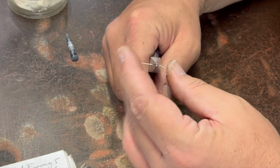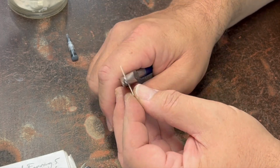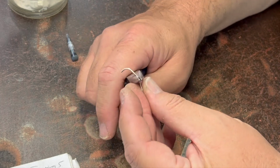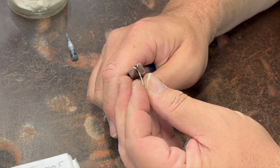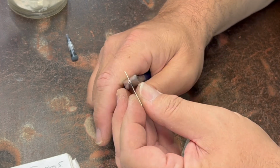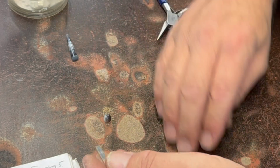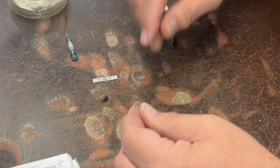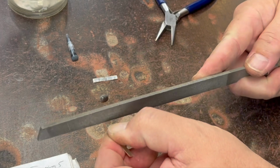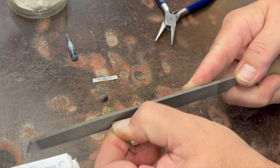Okay, if you haven't seen my videos before, I use hard silver sheet solder for almost everything, and I use a spray-on flux called My-T-Flux. Anymore, I try to answer the questions people routinely ask me up front. My torch is a Smith acetylene air torch. I think they brand it now the Smith Silversmith torch, if I remember right. It used to be called the Smith Handy Heat years ago.